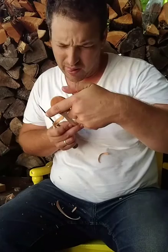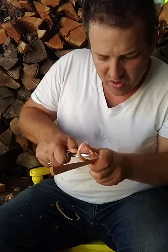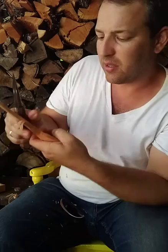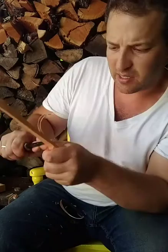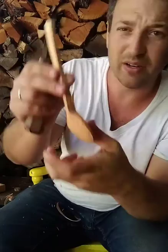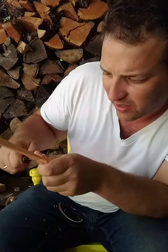At this stage, I'm just eyeballing the weight of the spoon bowl from side to side. Then I come around the shoulder with a thumb push. The reason we got that rim so narrow is that with a narrow rim, you're able to do a thumb push going around and sustain it for longer than if it was wider. The narrower the rim, the more of a long controlled curving cut you can take. I need to be mindful that I haven't reached depth in the back yet and adjust my cut accordingly to avoid over-cutting the neck.